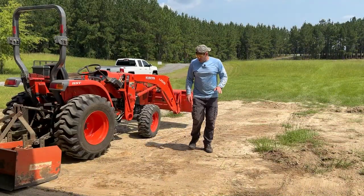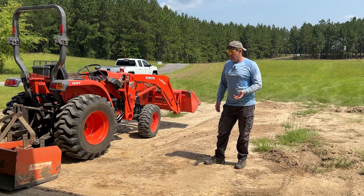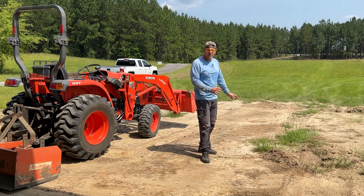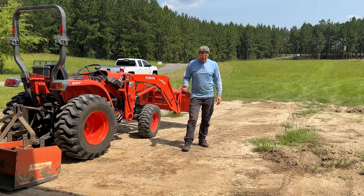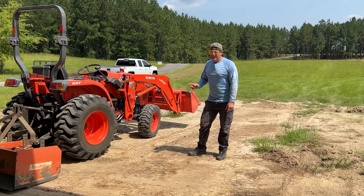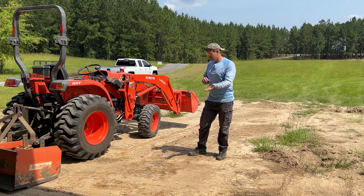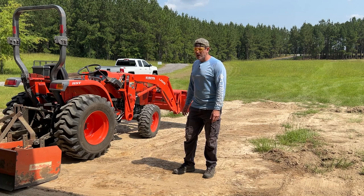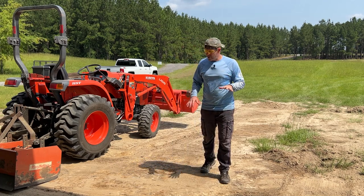Yeah, that kind of did what I thought. It is so hard-packed clay here. We haven't had much rain in the past week or so, and even if we did, most of that's going to wash off and not soak in. So this is pretty hard-packed and dry, and that box blade is literally just scraping the top quarter inch or so. I could drop the scarifiers on the front of the box blade so they'd rip ahead of the blade, and that would help some, but I just think that's not the right tool for the job - it's going to take too long. So I'm going to jump on the excavator and get in here.